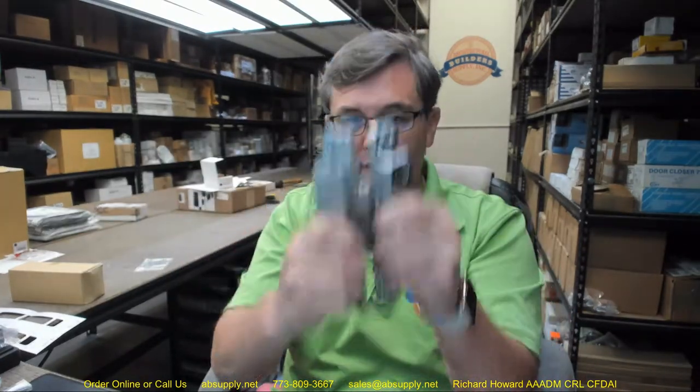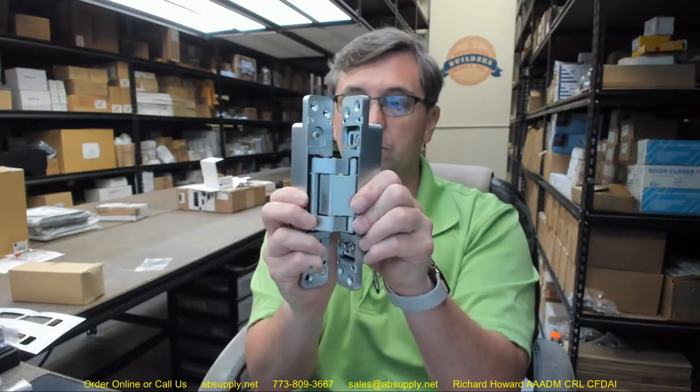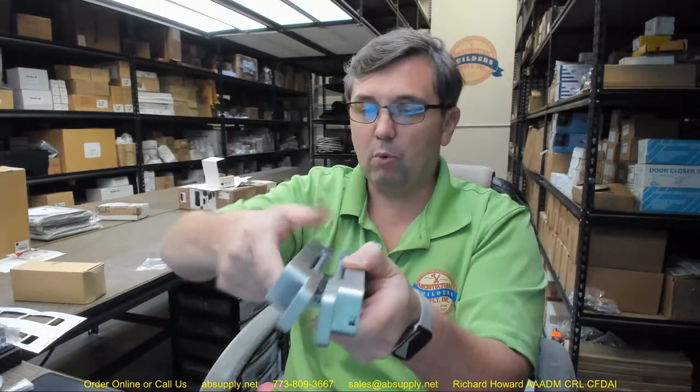The caution states: it is necessary to manufacture the frame with sufficient strength to endure the weight of the door and impact shocks upon opening and closing. Make sure to only use the designated screws and fasten them firmly — loose screws or a cabinet with poor strength might result in the door being dropped and cause injury. Do not use this product for purposes other than originally intended. The load is meant to be carried vertically — not laterally — so don't hang weight in an unintended orientation.